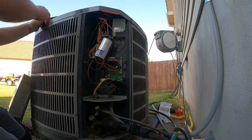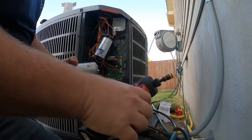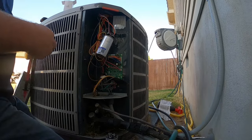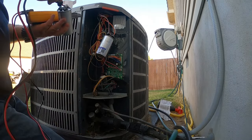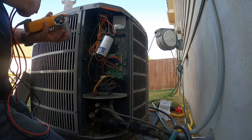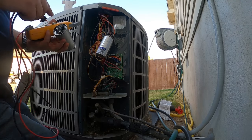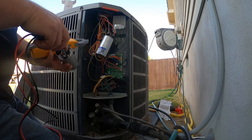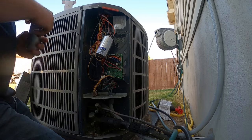It's a 45.5 — let me go grab one real quick. We have a 45.5 replacement. I better test this thing. I don't need to test the old one, I know it's bad, but the way they make things these days, I've seen a capacitor come out of the box reading 15 to 20 percent lower than it's supposed to be. Just out of an abundance of caution. Reading 45.8 and 4.995 — we are going to be fine.